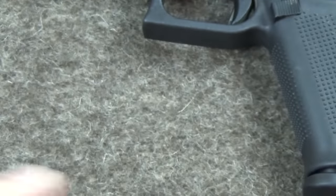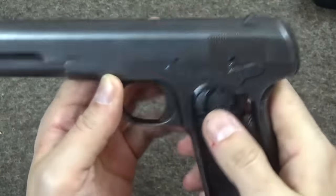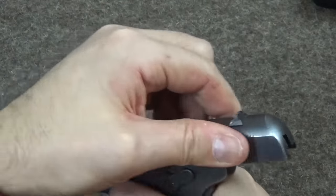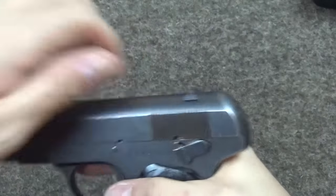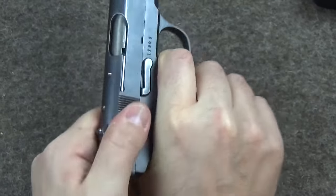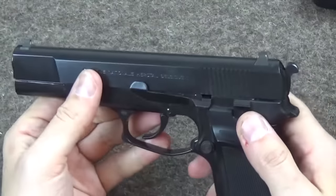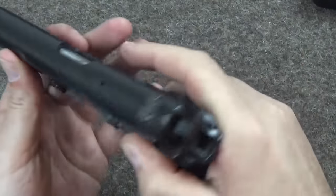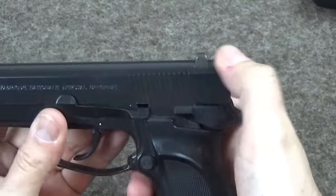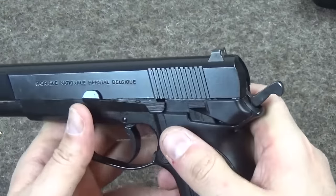Another example of similar era is the FN 1903. This looks like a striker-fired pistol but it's actually hammer-fired — the hammer is cocked fairly early in the cocking cycle, so it's either empty or it's properly cocked. You can't hook it; you can't do anything strange. It cocks early enough in the cycle. For completeness I've also got a double-action pistol here — similar concerns, but you've got a big decocking lever. It's basically a double-action Hi-Power, and the decocking lever drops it onto the half cock.